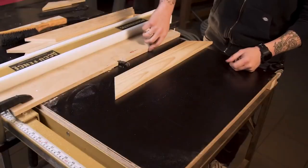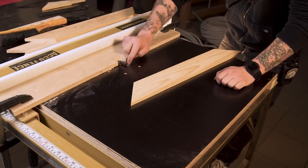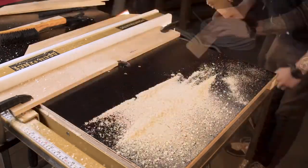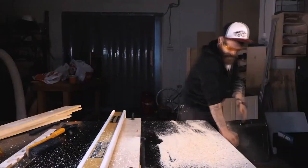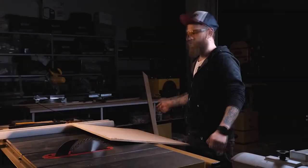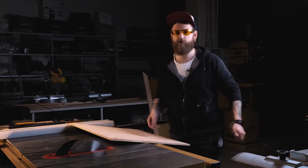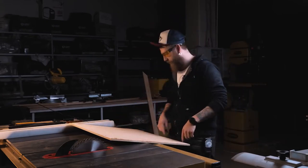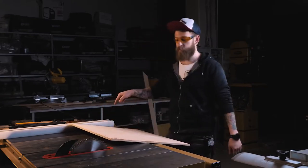The groove is two centimeters deep and five millimeters wide because, as mentioned earlier, my mirror is chipped a bit. Now we make the back part of the mirror out of plywood. You can use a fret saw and be done with it. I want to make it quick, so I'll use the jigsaw. I'm not bragging — I'm just a nice guy with a little time.